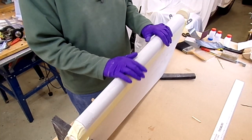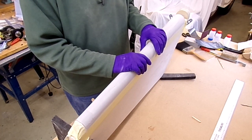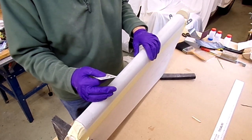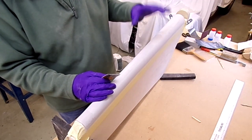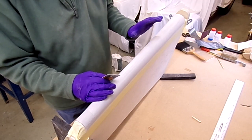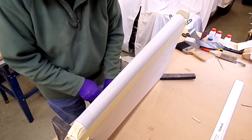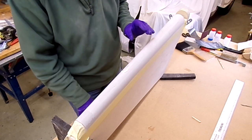Sand it down, blown clean. What I'm going to do now is put a very dry micro balloon mix on the leading edge, just to fill in any imperfections and to give it a slightly harder finish, stopping soft pure resin from soaking into any depth and making it heavy. That'll be easily sanded, just to make sure we've got the final profile right. And from there we will be able to progress on to doing the glass fibering.